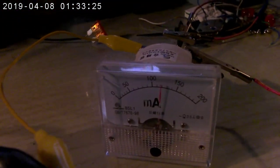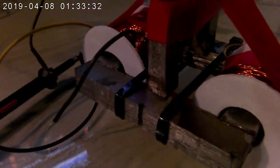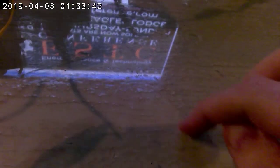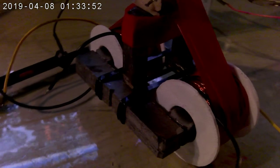There is a very strange effect that some people are seeing with transformers. This one is currently going through an isolation transformer from the mains, so it's 110 volts going in at about 120 milliamps. This strange effect manifests itself in a couple of different ways. In some instances on the scope, people are seeing sine waves on the input and also a sine wave on the output, but they are out of phase with each other. The other effect is seeing a sawtooth wave.